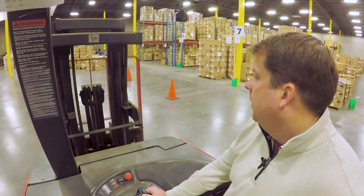It's key to just have more practice driving. The more you get in there and do those tight areas, the better — it's always better to set up a training area where it doesn't matter if you hit a cone initially. For a new operator that's really, really important. Finally, I'm going to show the dead man pedal: this is not something you want to use to stop. If I'm going forward really fast and I let off the joystick, I'm just gliding. To stop I pull back on the joystick. What you'll see is if I'm going forward and I let my foot off the dead man pedal, it'll stop abruptly — that's generally what you don't want. That would be a safety emergency. Generally, you want to keep that pedal down and stop with just the joystick.